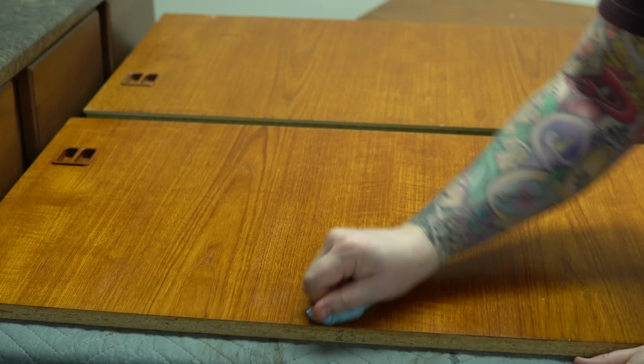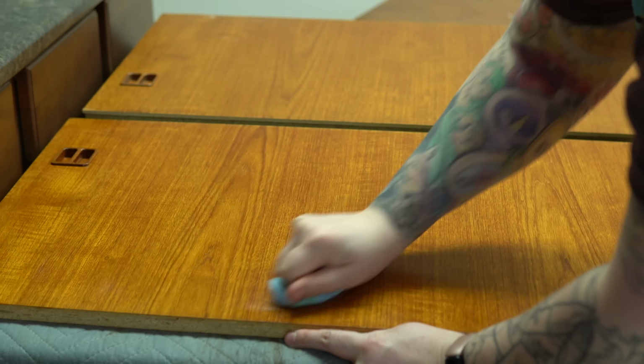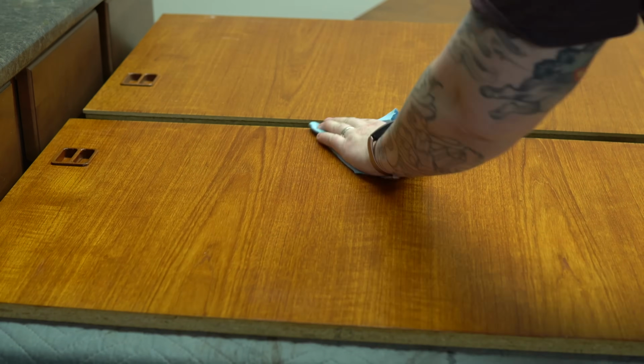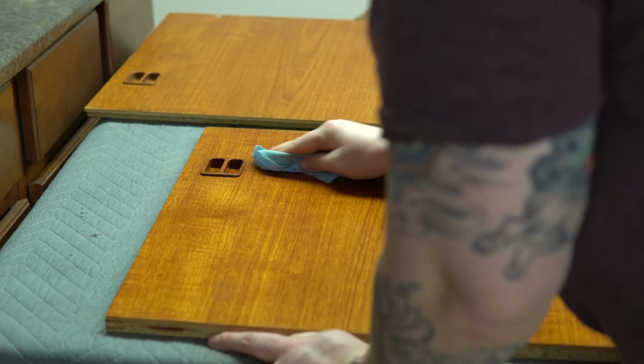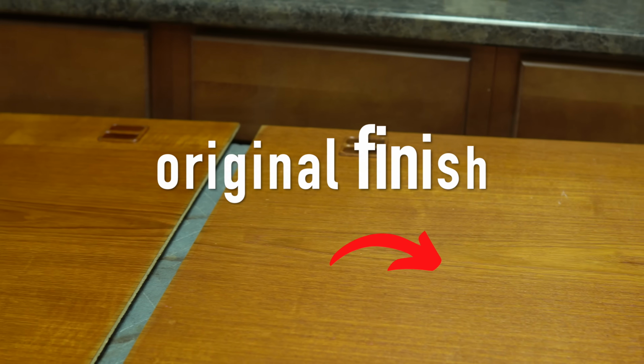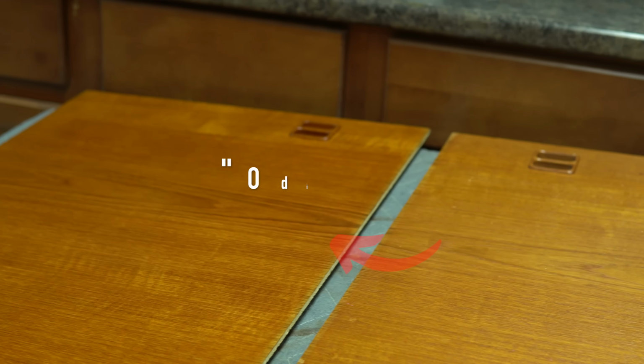This buffing process is extremely important when you're using Odie's oil. Most of the time, if someone doesn't have a good result with Odie's, it's because of this process. They either put too much on and the excess oil is too hard to take off, or they just don't do it long enough. You have to remove all of the excess product from the wood surface. If you run your fingers over it and it still feels oily, you didn't remove enough.